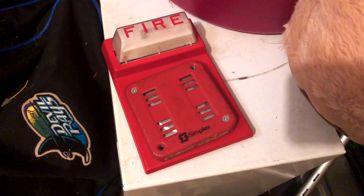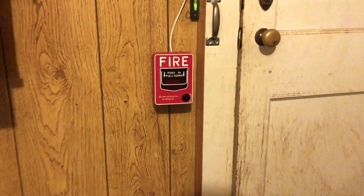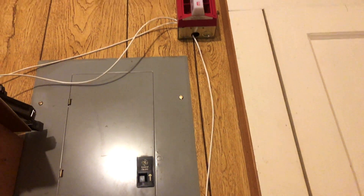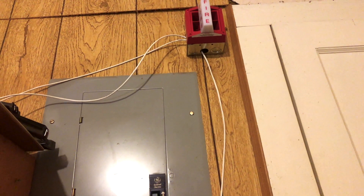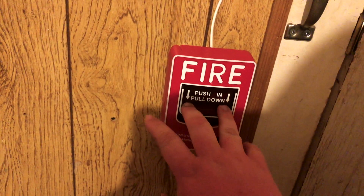This is in the garage, and this alarm here is going to go in the kitchen sometime, so hopefully by the next system test. Without any further ado, let's go ahead and get this started. The panel is coding the MASS to code three, and the MASS is set on 800 hertz. The MASS also does audible silence. Here we go: three, two, one.